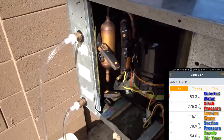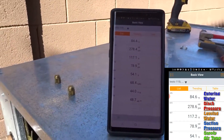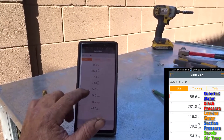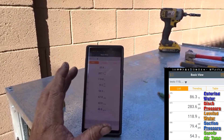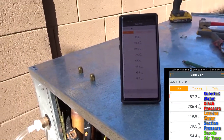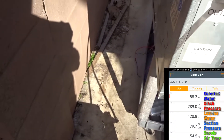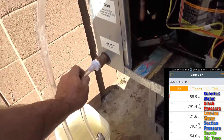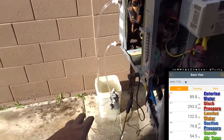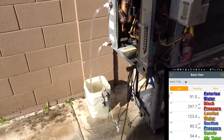Because it's a quick test, maybe I won't increase the frequency of that compressor above 60 Hz right now — running at stock speed. We'll just let it go until we do some more tests. 54-degree supply air. Pressures are 282 over 79. I'm hearing air, so we're probably not getting the best gallons per minute through this thing right now. I need to get some better fittings. If that doesn't move enough water, I was going to try to get a different pump on there.